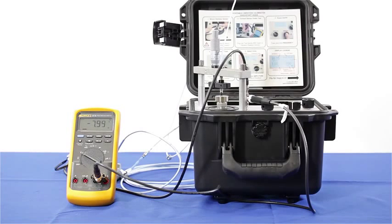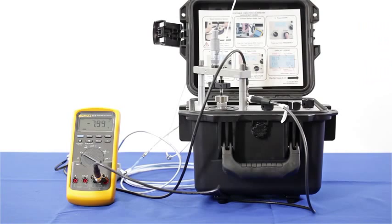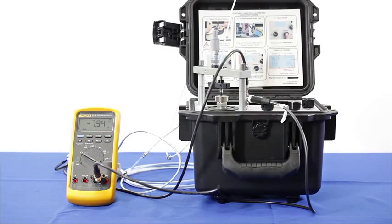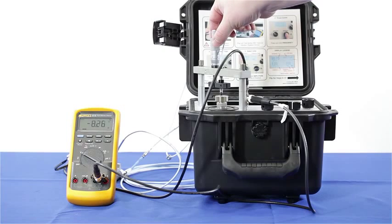Here's where relying upon gap voltage can actually cause increased dynamic output error. The incorrect system with 5.5 meters of cable has caused the gap voltage to drop to negative 7.9 volts. It started at negative 9 volts, so if a technician walks up to the data acquisition system and presses the gap voltage button, it's going to indicate the gap voltage is a little low. The technician may think the proximity probe is installed incorrectly and actually change the distance of the probe tip from the shaft — when the problem has actually been caused by the incorrect cabling.